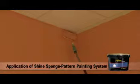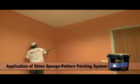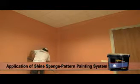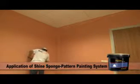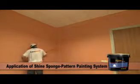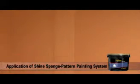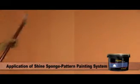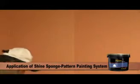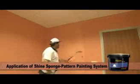As in the first coat, in the second coat application the roll should be used in one direction only and no traces should be left. The consumption is 250 to 300 grams per square meter for 2 coats depending on the smoothness of the surface or the application technique.